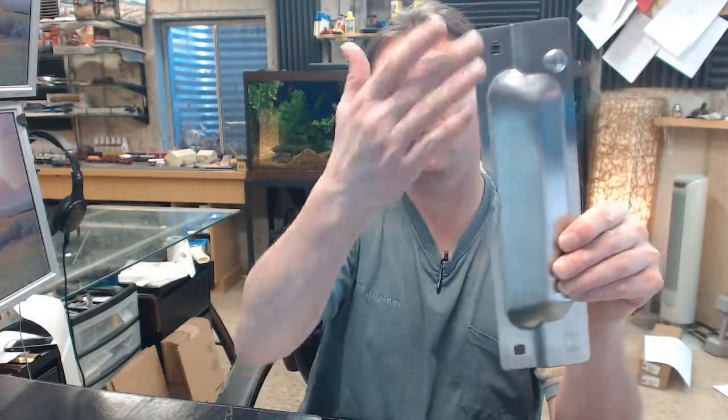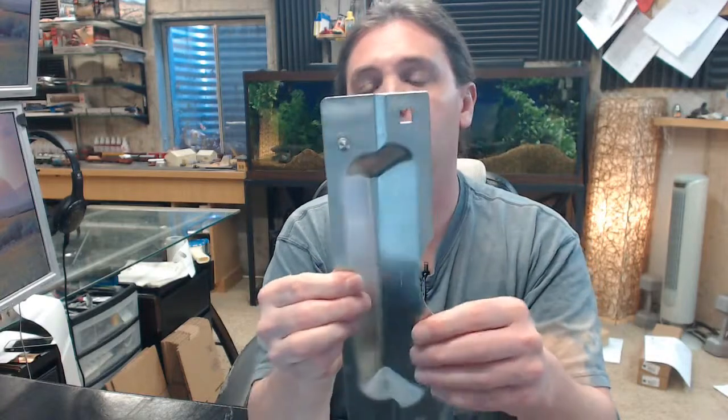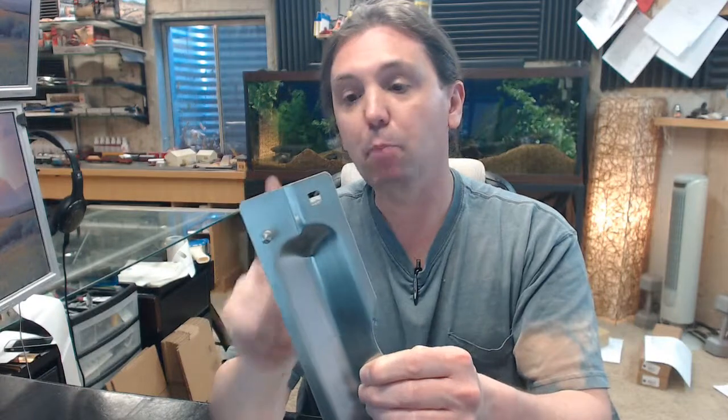Then, once you have that installed, you're going to mark on the frame where the pin makes contact. Okay? You're just going to want to mark that however you'll go about doing that. You might just give this a very light tap just to mark it. You're probably just going to mark the paint that's on there anyway. And then you'll use a center punch. You'll be careful to drill that hole to allow the pin to go into the face of the frame. You might have mortar packed in behind that.